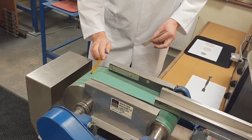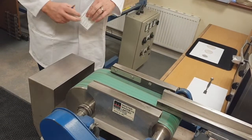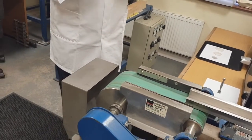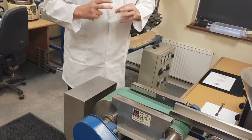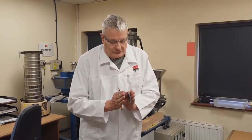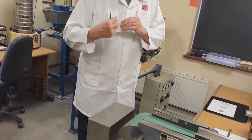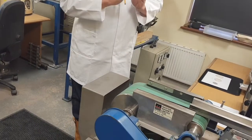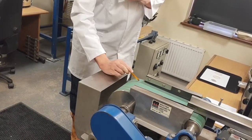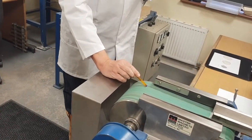This particular roll is of special technical interest. It's made up of couplings of neodymium, boron, iron — rare earth magnetic disks — that are placed north pole to north pole and south pole to south pole along the width of the belt. The effect of that, by putting an iron pole piece in between, is that we get a very high field strength and also a very high field gradient on the belt surface itself.